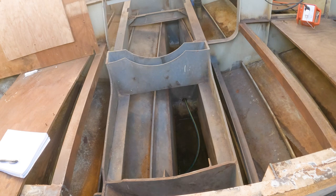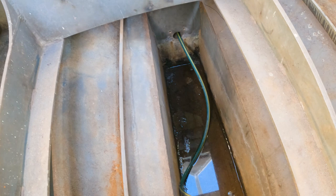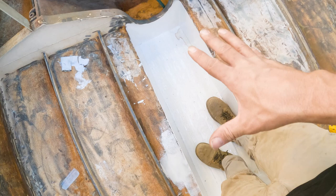And this is the area I'm looking at putting the electric motors. You can see over the top there, we've got a stern tube going out the back. The stern tube opens up there where this hose is coming through, which I use to siphon out all the water until I can stop being lazy and put the bilge pump in here. The bearing for the prop shaft comes through here, and this bilge area, which we've recently done, is where the diesel engine would originally go.